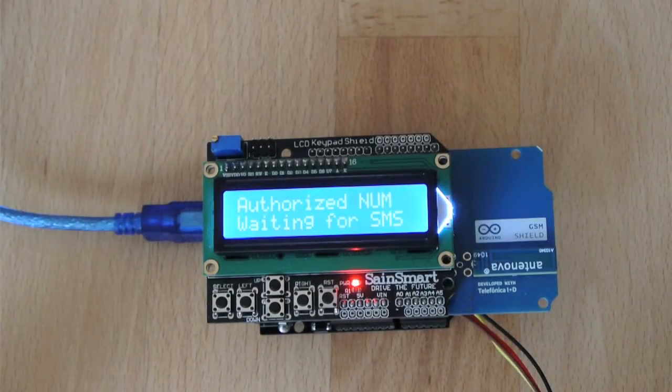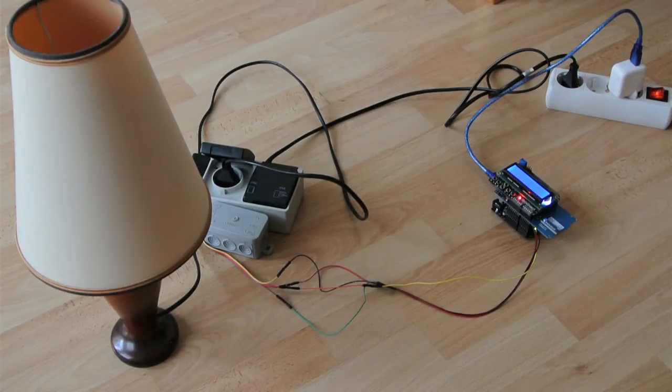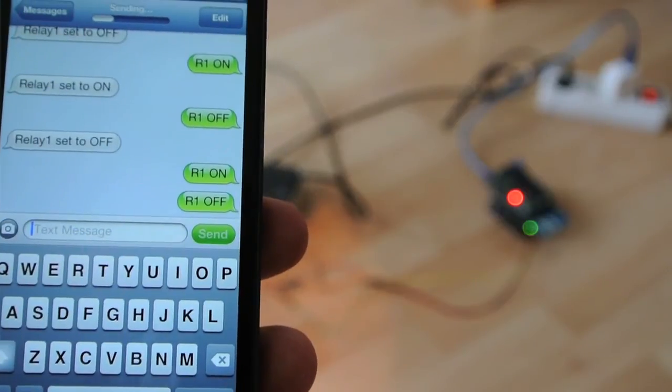The most important thing is that you have one telephone with SMS. The nice thing is that the Arduino controls who has sent the SMS and ignores any number that is not recognized in the list of authorized users. How it works: into the electrical plug there are two relays — I can put up to two electricity devices. I can send an SMS that is 'R1 ON' and it will light up the first relay and the first electrical plug. And then if I send 'R1 OFF', it's going to switch it off.